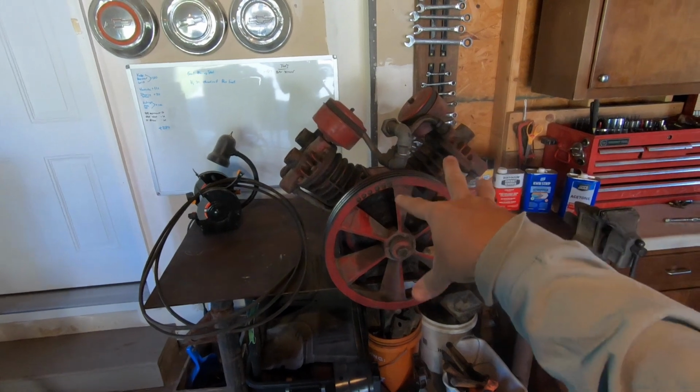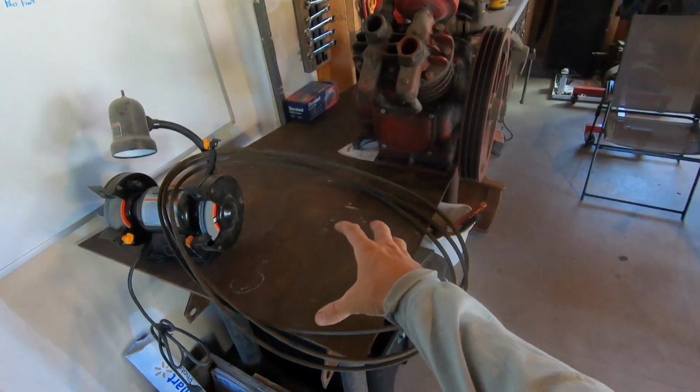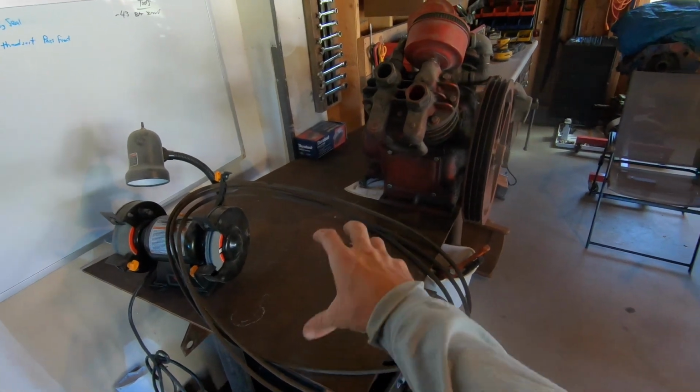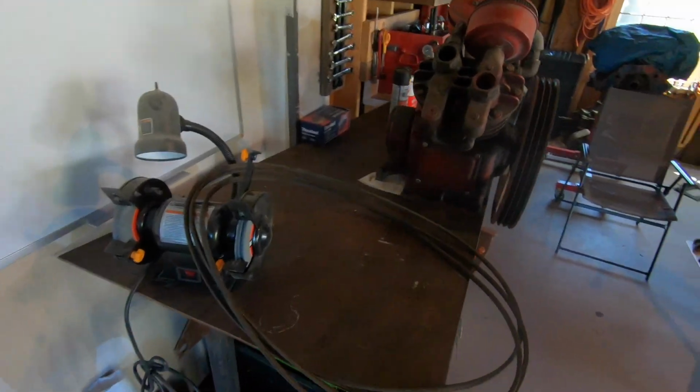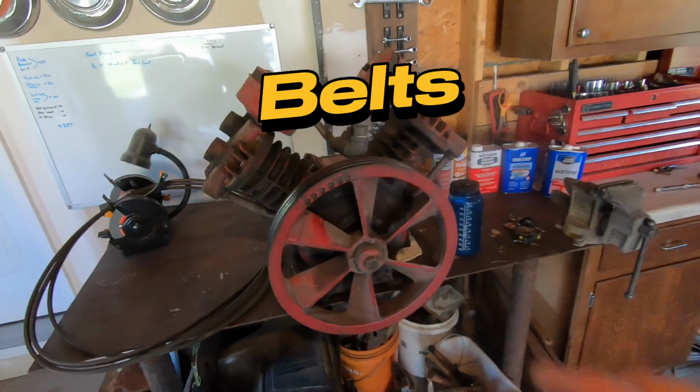All the air that this pumps runs on a line into your tank. Your motor sits over here and it is a slider, kind of like your alternator, so you can adjust your pulleys. This thing has so much torque that it has 3 pulleys. This is like lower RPM too, so it sounds like a tractor running. It's real lopey. Do, do, do, do.